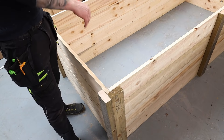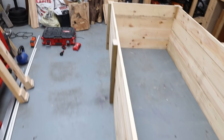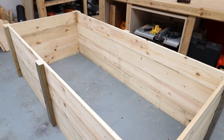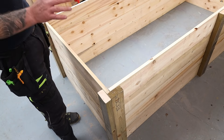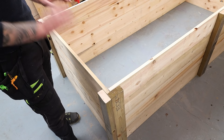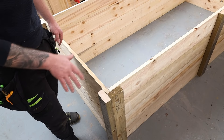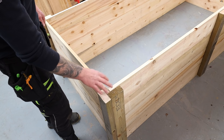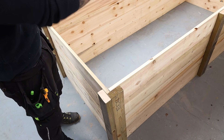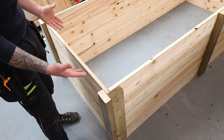The main body of the planter is assembled — took all of ten minutes. The two-by-four legs in an L-shape, short side in first then long side, screw everything together — it's nice, quick, easy, and extremely strong and stable. I've built workbenches, racks, shelves, and planters with this method. I'll link to previous videos below for more depth. I've also added a leg to the center just to give it a little more support on that long span.